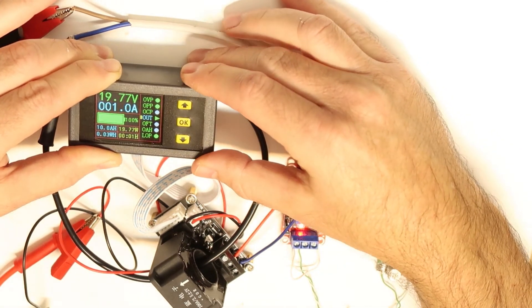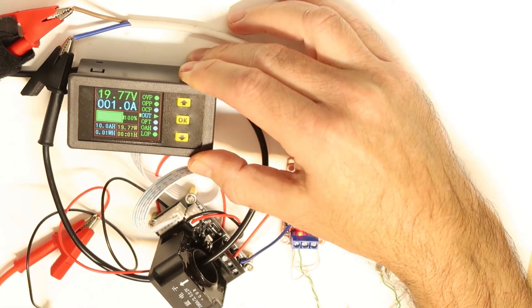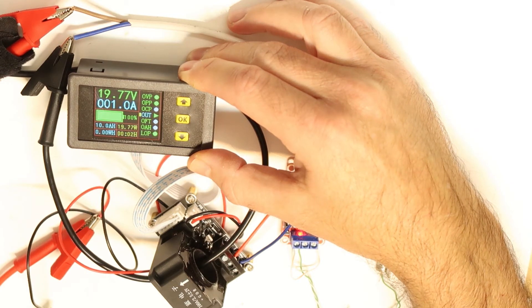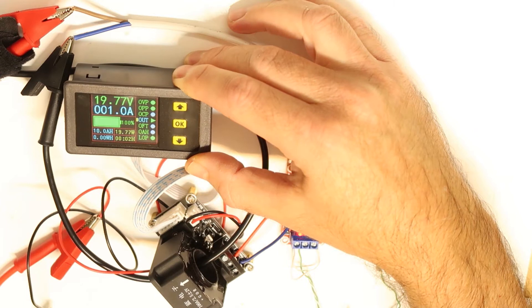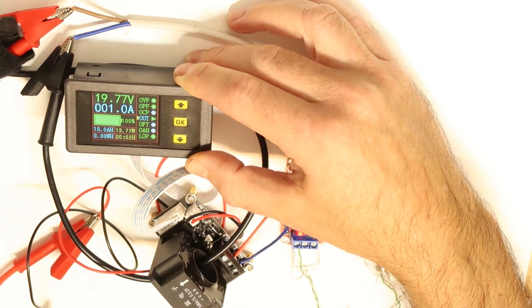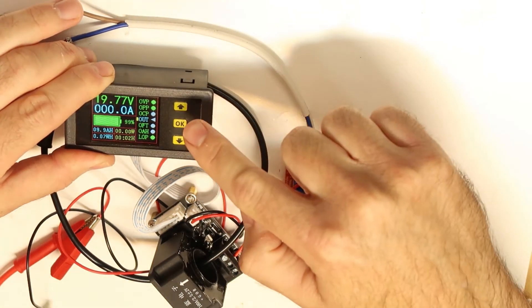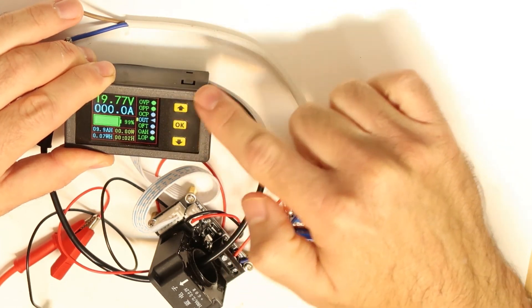So now if I'm above 25.5 watts it will disable the output. This feature is now on. Going to output — the power is currently 20 watts. I'll raise the current to 2 amps, which will push it above the threshold — and click — did you hear it? It disconnected. We've verified over-voltage and over-power protection, both working perfectly.